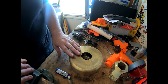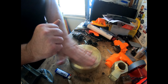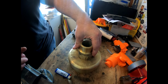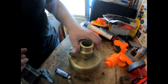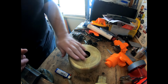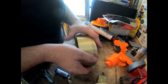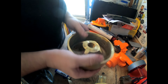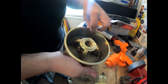This is nice and flat on the bottom, right? When we welded this piece on first and machined it, what happened was that this pulled a bit, right? And when we sat this on here, basically it was rocked like that. And not straight, wherever you put it, it's just wobbly. So I thought, that's all right. But then we've welded this here, and it's fixed it. And this is perfectly flat along the back, which is really nice. And everything's to size, so we've got what's basically steam tight here, and we've got a good machined lip here. It's not quite concentric, but it's not terrible.